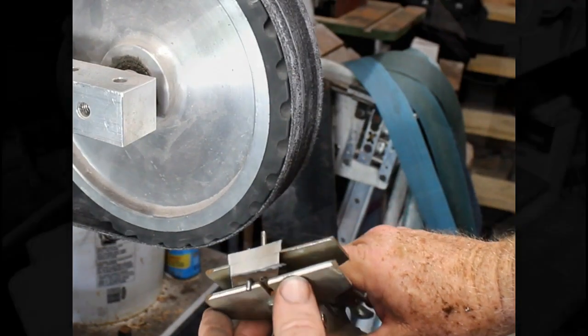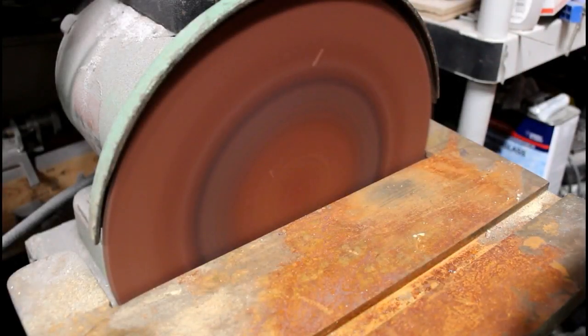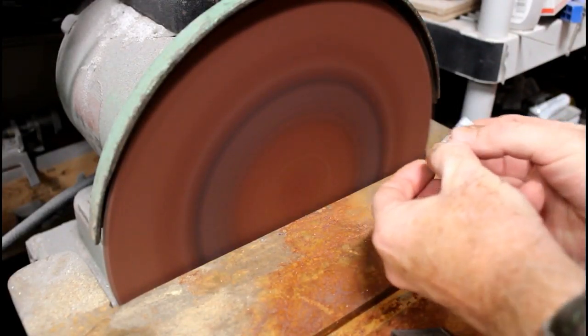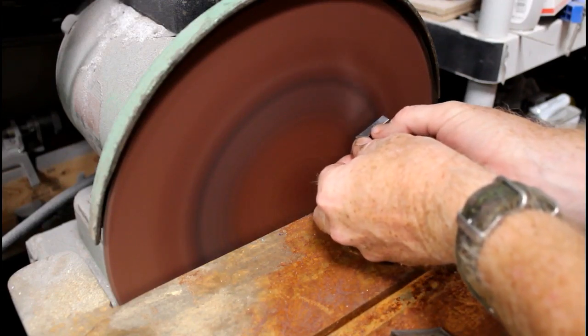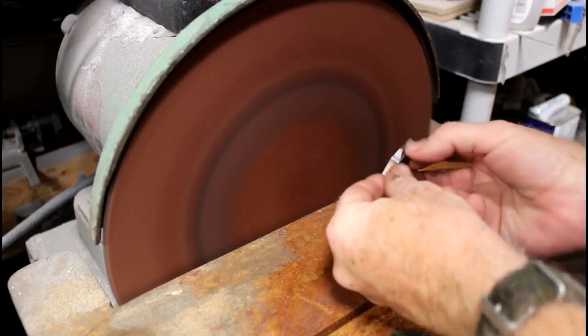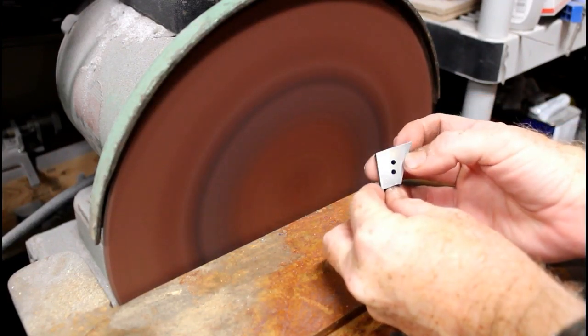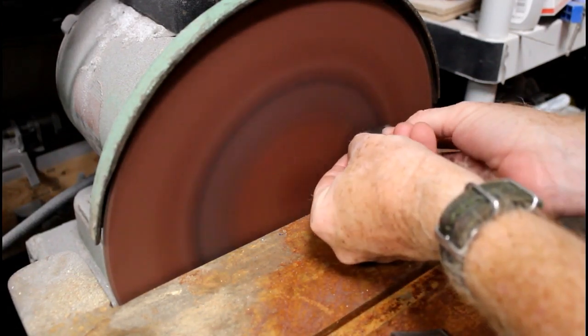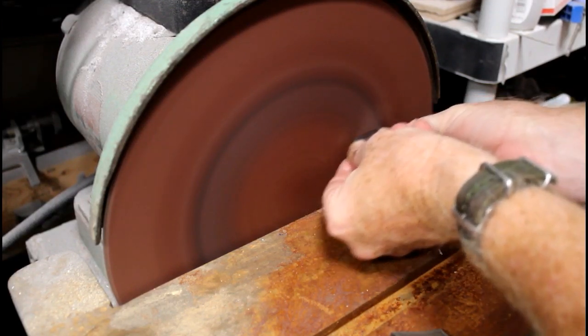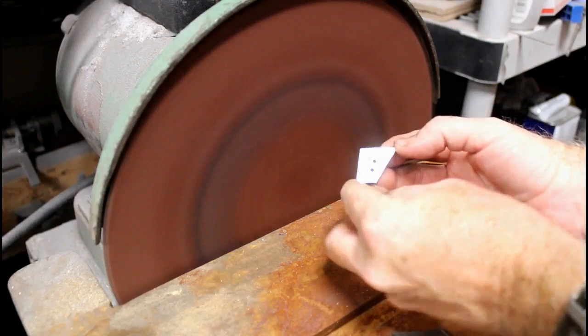The felt belt does a great job with this. Alright, so now we're going to go over to a disc grinder. Really important when working with bolsters that the material is absolutely flat. You would think you would be able to do this on the flat platen of a 2x72, but the belt is actually not attached. It flops over that flat platen. You'll get a much flatter surface doing it on a disc grinder.